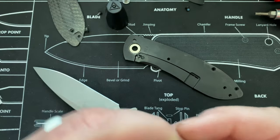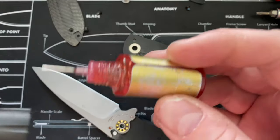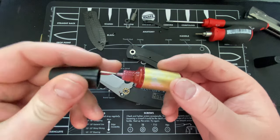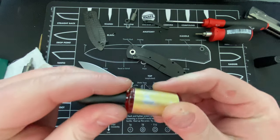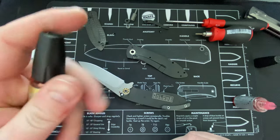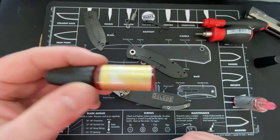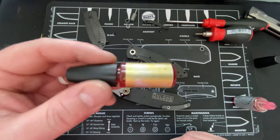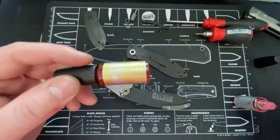And I guess I'll explain. The point of this stuff is it's a little heavier. So, it's supposed to stick and stay where it is. So, putting it on a detent ball and a detent ball track is good because it's a moving object. It moves a lot. And you want this to stay in place. So, you use the heavier stuff.